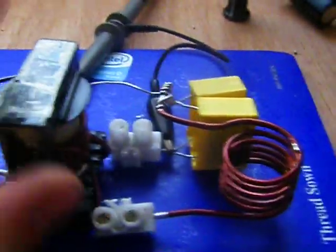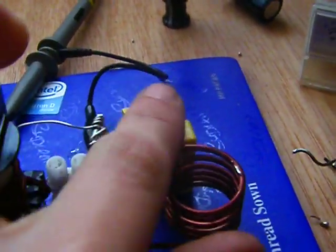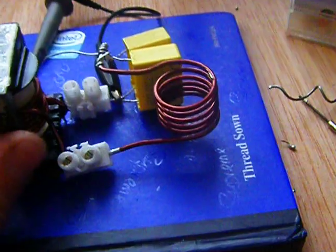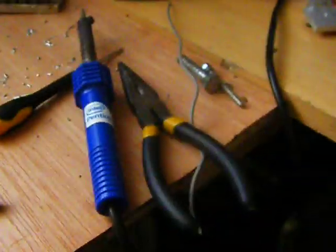This was my first attempt. That is hot — the transformer secondary gets hot, but not the work coil. The capacitors are hot as well. If you are building these types of induction heaters, never put a probe near the capacitor because it will melt — I melted mine. It's a small little induction heater that works perfectly. I'm really satisfied with it. I think I'll have to submerge it in oil or water. This is me signing off — thank you for watching this video.